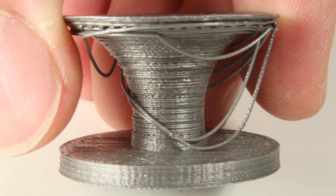Let's start off with temperature. Most filament you buy will have a sticker on it which says an approximate temperature range to use it at — mostly around 180 to 220 degrees for PLA or something in that range. Depending on your 3D printer, even a few degrees difference can make quite a big difference in the print result. Here I used 240 degrees on PLA, which is quite a bit too much.